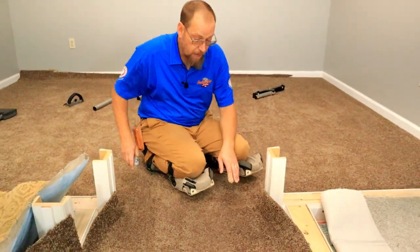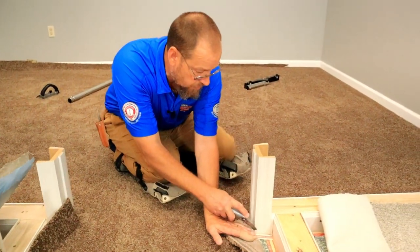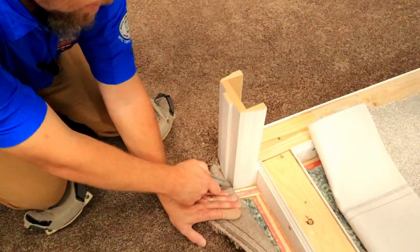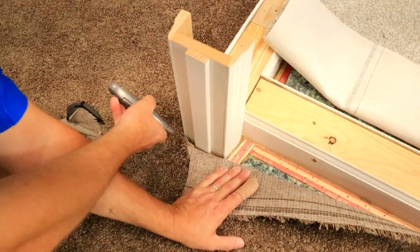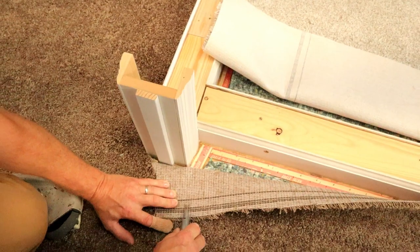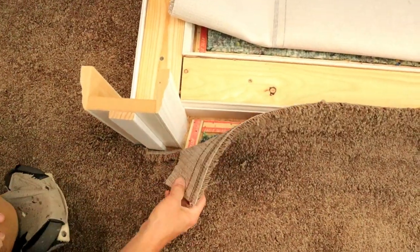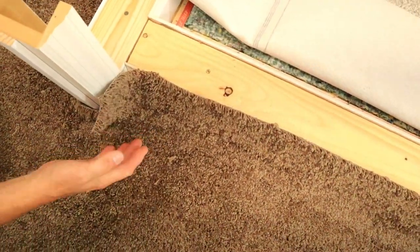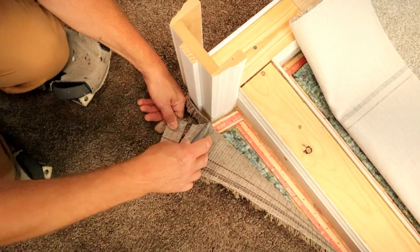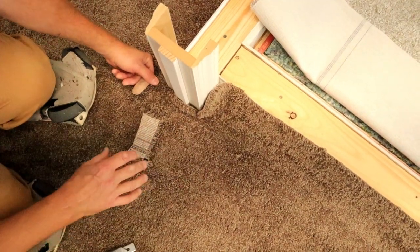What I need to do right now is go ahead and cut just the doorway down here right to the casing. When I make this cut, I'm going to come back from the corner point that way — definitely don't want to come straight or you're going to stretch off. So right back around that way, you can see how much extra I've got right there after that. If you want to trim a little bit, you can come back here instead of right at your corner point — that'll still give you about three-quarters of an inch or so to play with whenever the time comes.